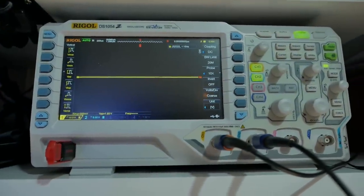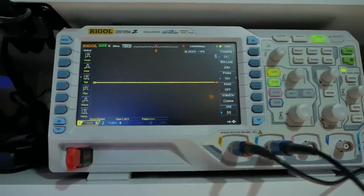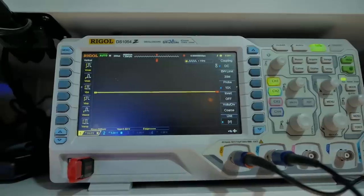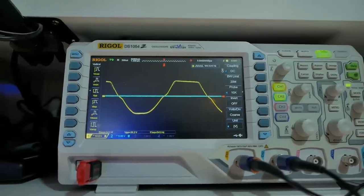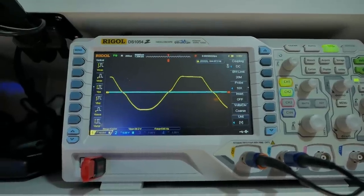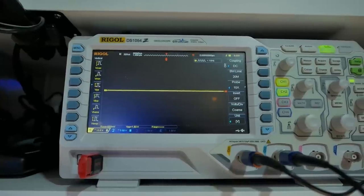All right, so I found that the distortion was occurring after V1B, and that happens to be the point that feeds the reverb. So on a hunch, I just removed the 12AT7 reverb driver, and now that weird sort of wave-foldery effect is no longer occurring. So I wonder if we might have a failed reverb drive transformer.